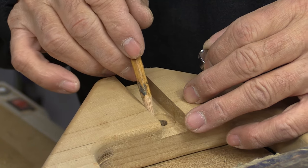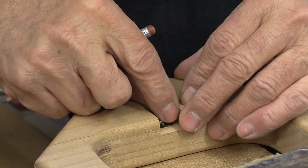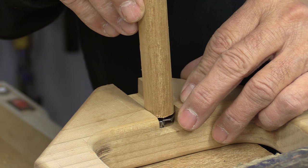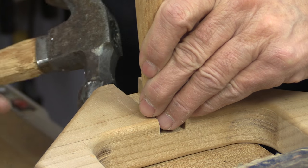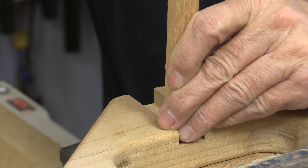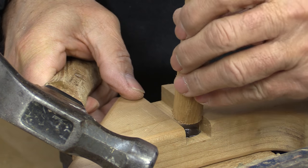While I was at the drill press, I did a little bit of countersinking, and now I just want to seat this T-nut in here. You could use a square, but I happen to have a round dowel that's just about the right size. We'll seat that in there and it should be flush when it's done — and that looks good.